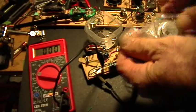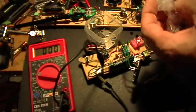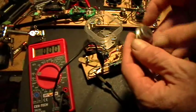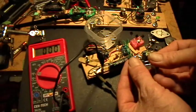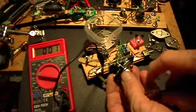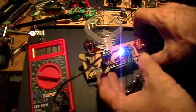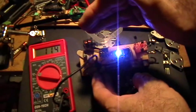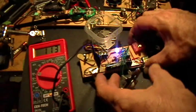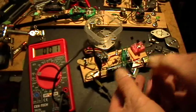I do have a brand new one here that I haven't taken out of the packaging yet. It's a brand new 2N3055. It certainly goes in the socket easier without solder on the pins. That's nice and bright, about the same as the others — 114 milliamps. So I guess that means some of the ones I have here are good.